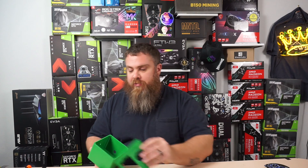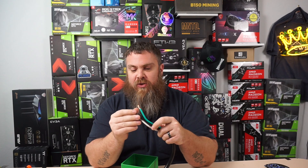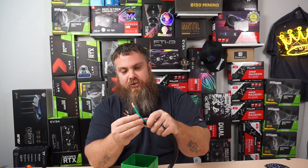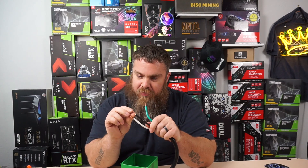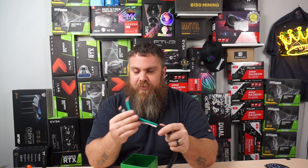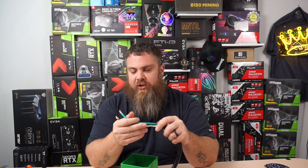The first thing we're going to do is obviously open up your box. The next thing is you're going to need to cut the sheathing on the cable. My buddy already did this for me who made me the other 240 box, so this is already kind of pre-done for me. But you'll want to remove this black sheathing right here, and then you'll get down to your two hots and your ground. You'll want to cut these back — probably about half inch to three-quarters inch. You'll want them to look like this, and this step was already kind of done for me, which makes it a little bit easier.